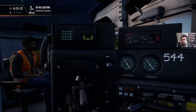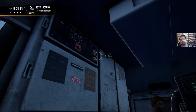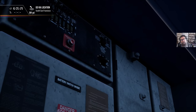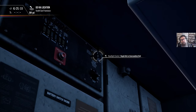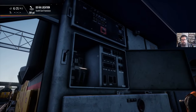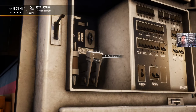We really want the automatic brake in suppression rather than full service because it will stop the safety devices doing anything strange. The next thing we need to do is make sure that our isolation switch is in start-stop isolate — and it is. We want to put our headlight switch into controlling unit with unit coupled at the long hood end, because we're the leading loco and the other one's at the other end.